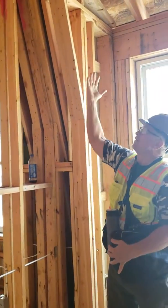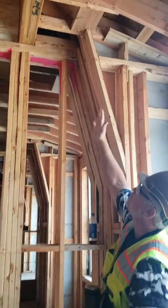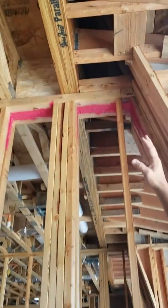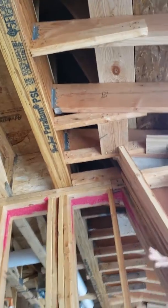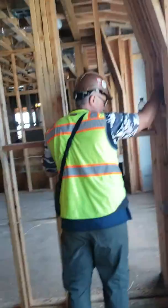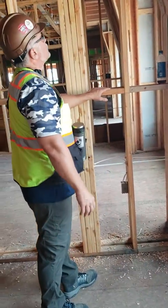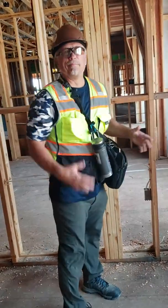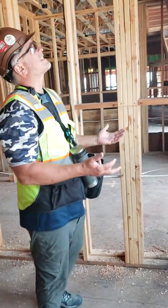It's impossible to air seal all of this. Take a look here. Even though it's sealed from unit to unit, we have these big parapet mansard dead spaces that are impossible to air seal, and then everything leaks into these mansard areas, which don't continue. So this is really taxing my abilities as an insulator to figure out how to properly do this.